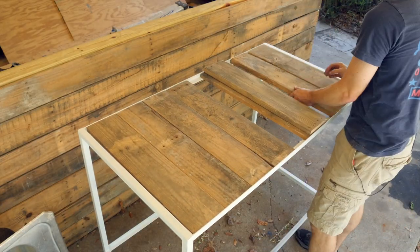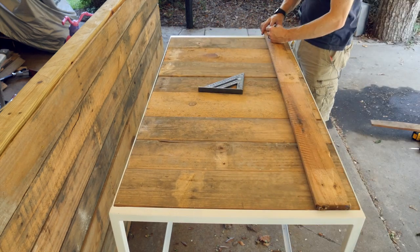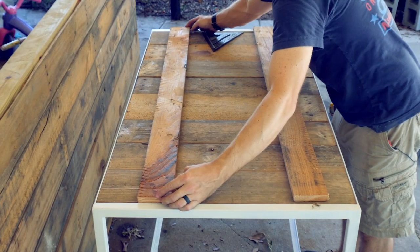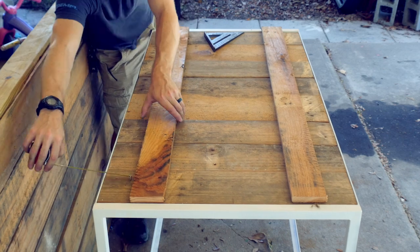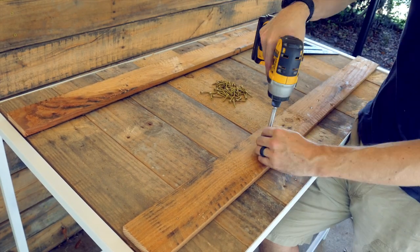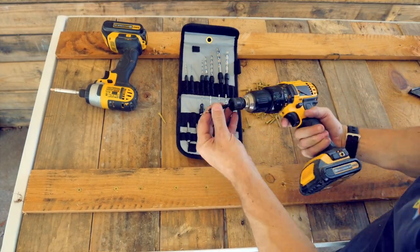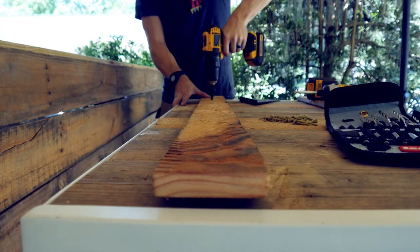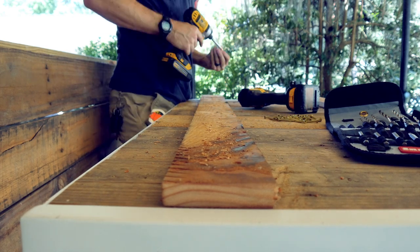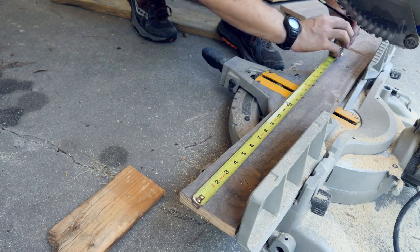It was easier to work up top than down below, so I laid all the pieces out, got them in the right order, and made sure to turn them all upside down. I had some other pallet slats that I cut down to length to add on the back side as supports to hold the whole thing together. I roughly measured the same distance away from the sides and started screwing them on with decking screws. I realized very quickly that I should be pre-drilling these so that they didn't split, so I pre-drilled the rest of the holes and added screws to lock them together. Since this is going outside, any split in the wood will get magnified over time, so pre-drilling is just a good idea. I flipped this panel over, dropped it into the bottom, and it fit perfectly.